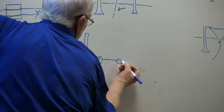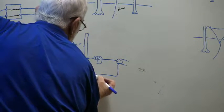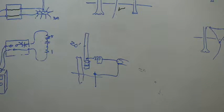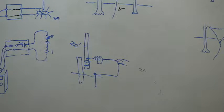Here's what he had. The coax went here, and the shield went down to a ground. And he kept talking about how he couldn't understand why there was a need for a ground rod, for a radial system, because his was working just fine. He also said that he had a perfect one-to-one match. He measured it with an analyzer, perfect 50 ohms.